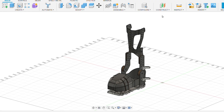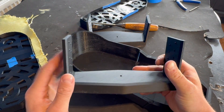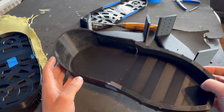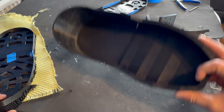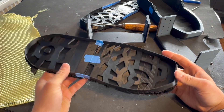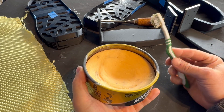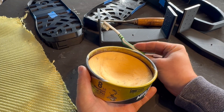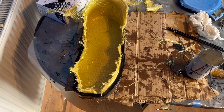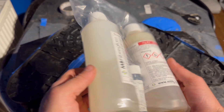With that said, let's get everything machined, printed, molded and see what it looks like when it's done. First up we have the 3D printed mold for the ankle bracket, ready for release wax. Then we have the main part of the boot ready for the carbon fiber and kevlar to be laid in. Then there's the mold for the boot tread — this will be tricky to wax but I've got a method. That favored method for getting wax into all the little corners is a toothbrush — works very well, don't knock it till you've tried it. I managed to get a clip of some kevlar going into the main boot.